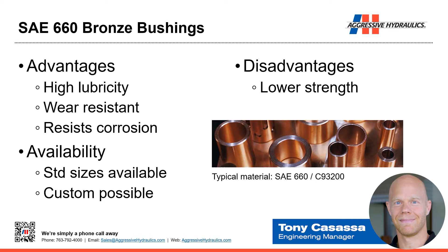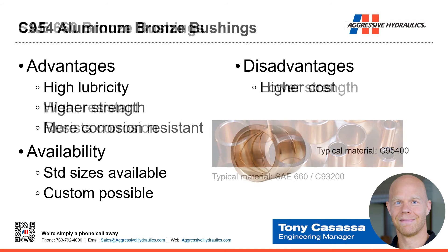There are some standard sizes available. Bronze suppliers have a lot of bushings they make as standards, and bearing supply houses keep things in stock. It's also possible to do custom — you could buy a bar or tube of bronze and make it any size or shape. The disadvantage is lower strength. Bronze is not as strong as steel. With a hardened steel bushing, the pin will probably wear out first. With a bronze bushing and a hardened steel pin, it's the bushing that becomes the wear item and has to be replaced or serviced.